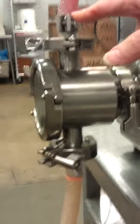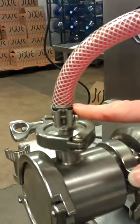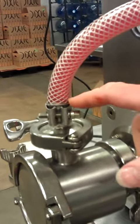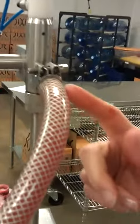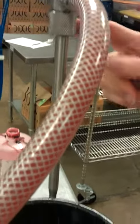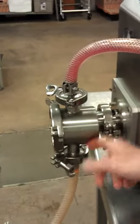And then up here after a while we'll begin to see... Typically after a little while we see air bubbles up here, but if you look up here, this stays intact. So the source of the air doesn't appear to be through any loose seals in here — it has to be entering the system somewhere in here.